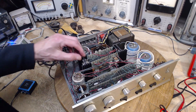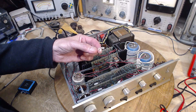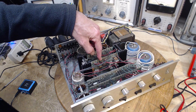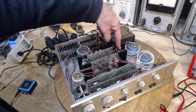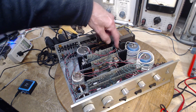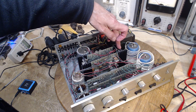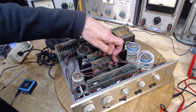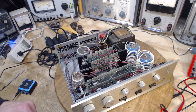So that's the story. To make this guy work again, I would have to change the burned resistors, change this transistor, and change the transistor here — and that's probably all it would take. The start of this failure probably occurred in the output transistor, which developed a short. With a short there, this guy overheats and burns out and shorts. And then once this is shorted, the resistors have their turn cooking.